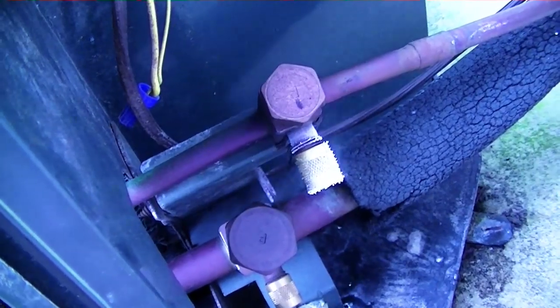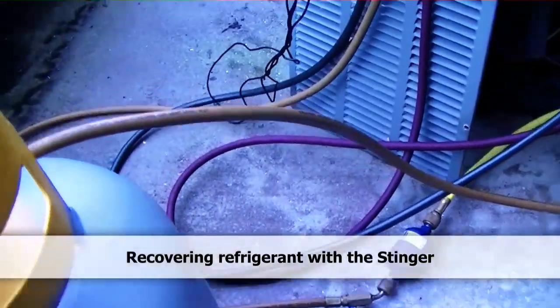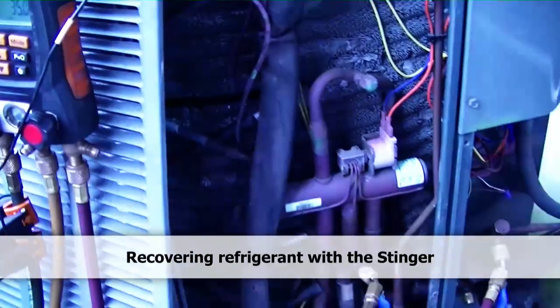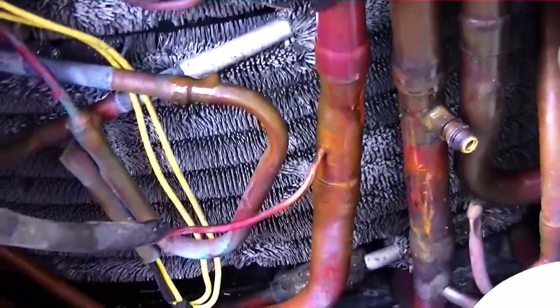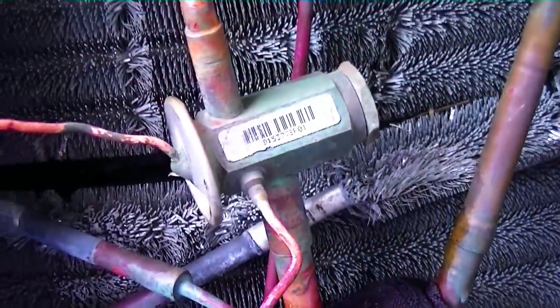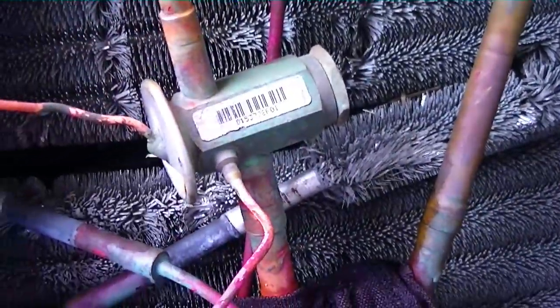I think this Schrader might have to come out too. We're about to sweat out this TXV — keep in mind we want to move our little wires out of the way for the defrost sensor. We're going to sweat the equalizing port out, sweat out the TXV here and here. There's a lot of play in it so it should actually work out pretty well — we should be able to pull out the top and then pull the TXV out too.